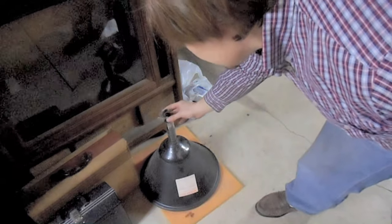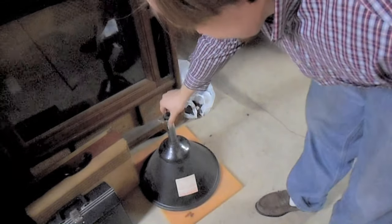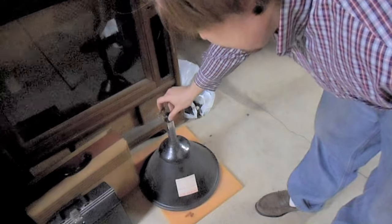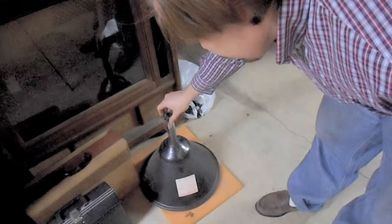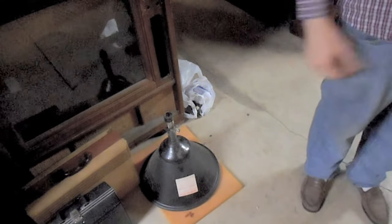Okay. Then I need to adjust the ion trap around the neck of the picture tube. It basically looks sort of like this. There are different shapes and styles, but you rotate it and you move it in and out, spin it all 360 degrees while watching the amount of light on the screen. Adjust it for maximum brightness. And if you're not getting great action out of your ion trap, flip it 180 degrees over and try it that way. And spin it and move it back and forth and see if that improves. If it makes it worse, put it back to where it was before.